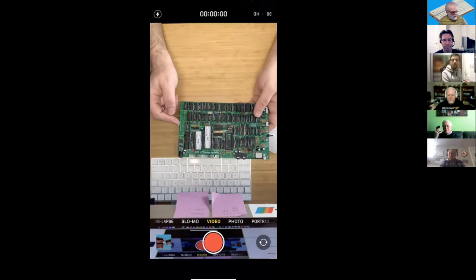And then with this one, he adds a DIV MMC. And the ROM chip, I think that's the SST chip, lets you put in multiple Spectrum ROM images. And then he also adds the AY, this is an 8912 sound chip. There's a couple of variations, and this is the 28 pin version. And all these chips are part of what goes into the ULA.